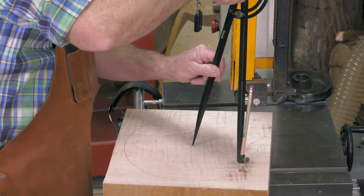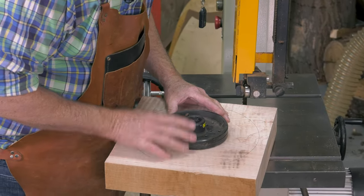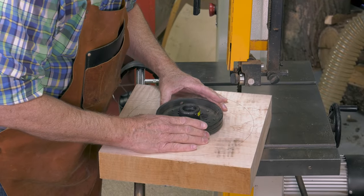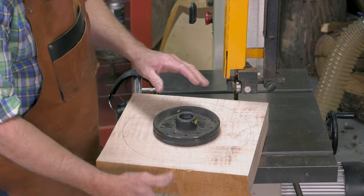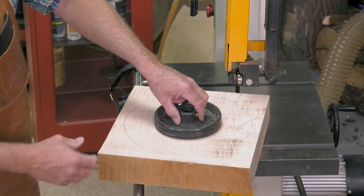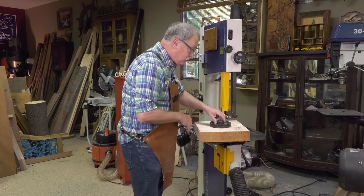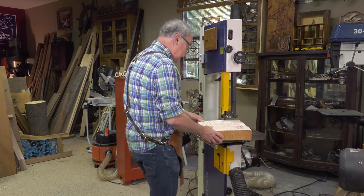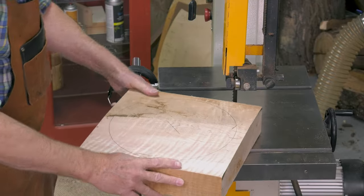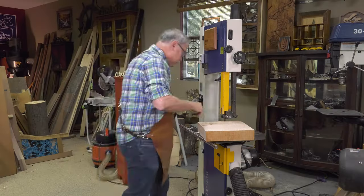You want to really make sure you mark that center point so that when you do the next step — lining up this face plate — you can center the hole that will mount this face plate on the wood lathe. This is the clock side right here; the back side is back here. We have to turn that spigot, and once we get the spigot, we can chuck that up and turn away the screw marks by removing the face plate. I've transferred the same circle on the back.